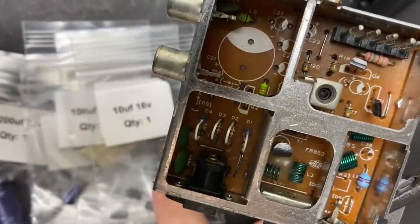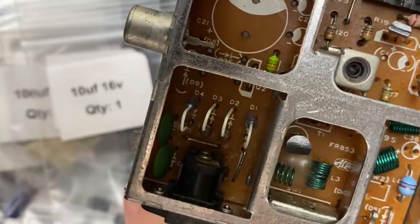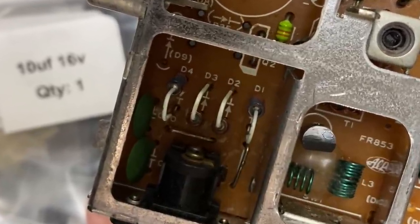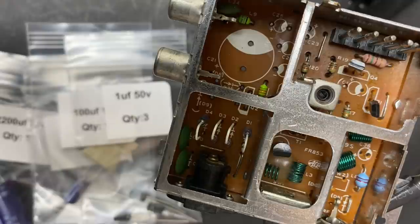And the reason the NES doesn't care whether you give it AC or DC power, that's because it has a bridge rectifier, which is those 4 diodes sitting right behind the power jack. Normally that's circuitry that would be inside a power supply, but the NES has that built in. So not only could you give it DC, but it also doesn't care about the polarity either.